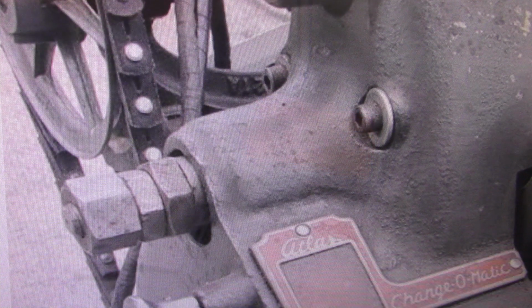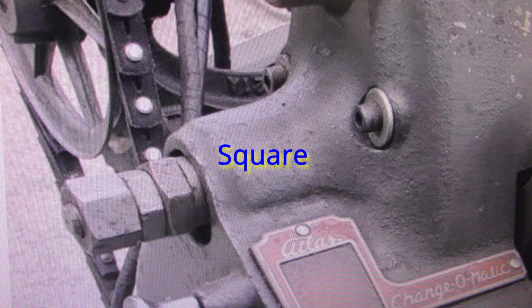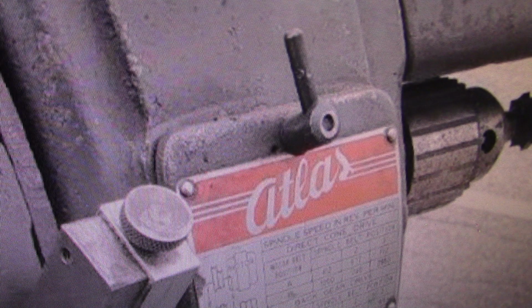The drawbar, I see about 3 nuts stacked out there on the end of that drawbar, so there's something really wonky there. Normally that would be a one piece that I've shown how I built one of those previously. There's no hex on the end, so you're just turning it with a wrench, it looks like. The door that would access the front of the headstock has some goofy handle somebody's built rather than the proper push to lock handle.